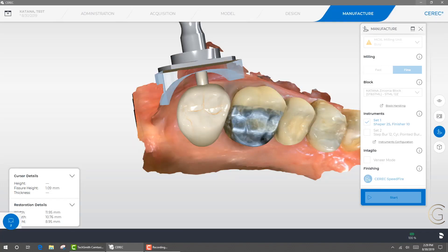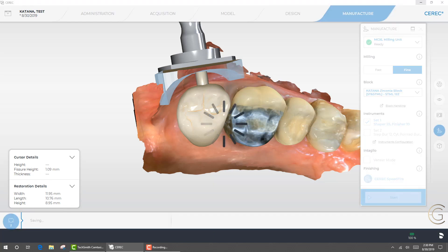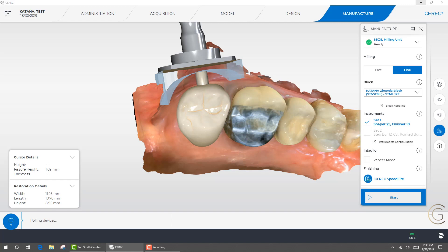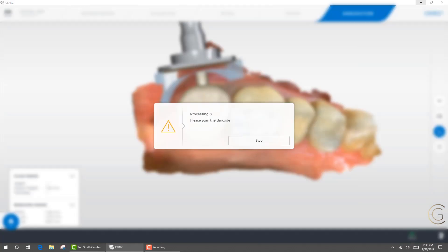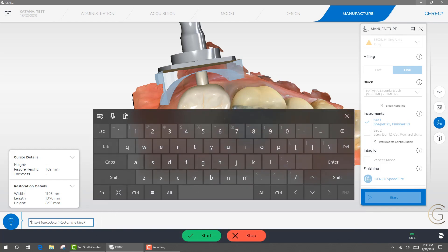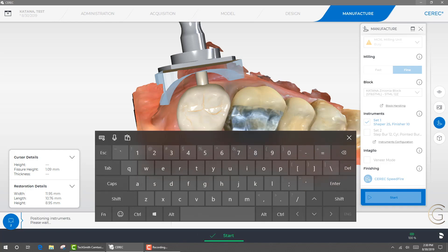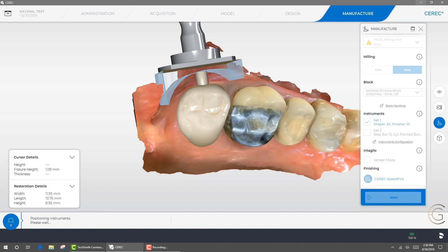I'm going to stop the milling and show you what to do. Going back to the start button — as it prepares, once you set this you're going to be fine for any future codes you put in. So again, we're going to scan the barcode — you don't scan it, you have to hit stop, and it brings up your touchscreen. What I'd like you to do is touch the touchscreen and move it up slightly so you can see the start and stop below. Start is in green, stop is in red. We're now going to input the code: F223FBA. Instead of hitting enter on your touchscreen, you hit the start button — and look at that, it goes straight through so you can mill.